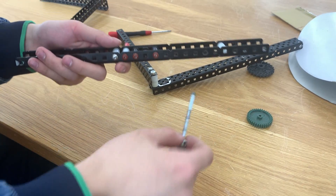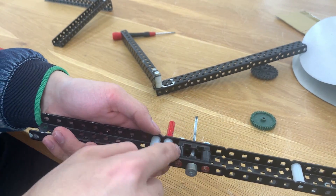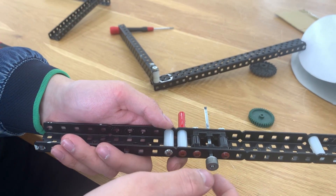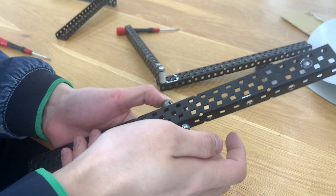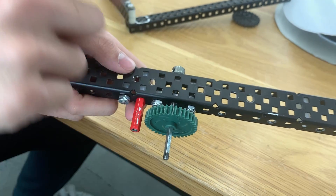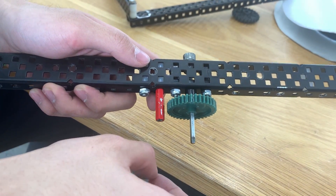Lastly, if you're trying to put a cantilever — for example, putting a bearing somewhere — you can also reinforce the structure by using two bearings facing against each other and putting spacers in between, then boxing them. As you can see, the bearing can be a lot better constrained this way, as you're basically extending where the support of the shaft exists.